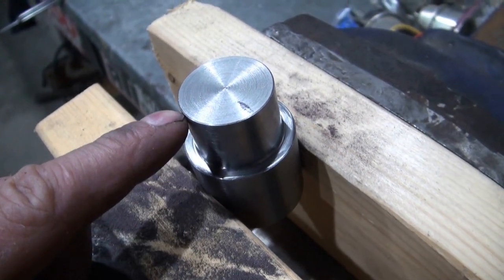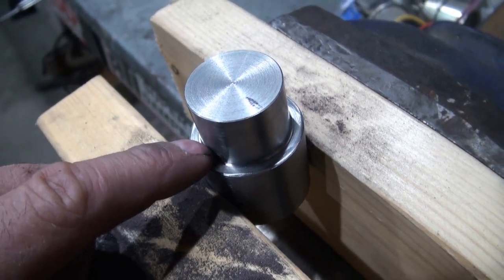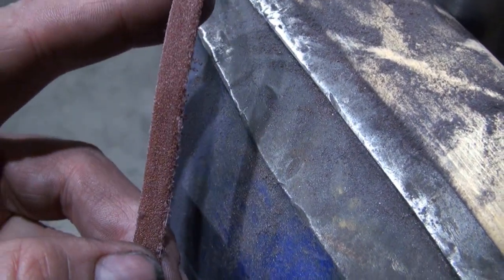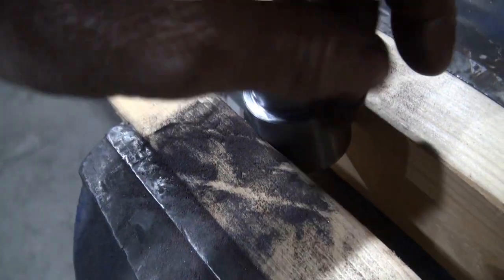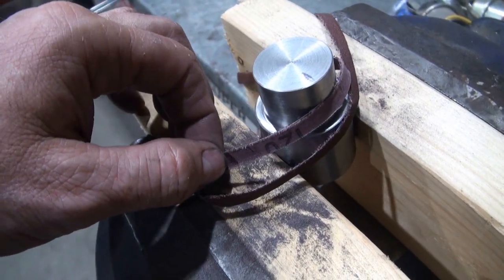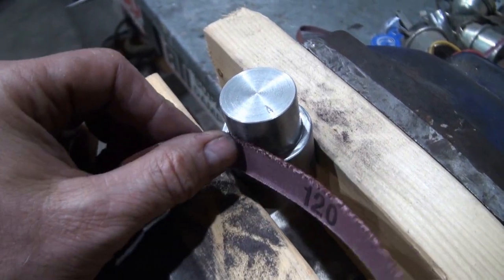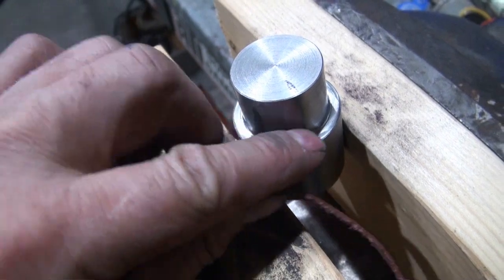The top end — I didn't want to remove any more there, it was actually very slightly on the small side already — and here on the bottom I needed to sand more. So I got some new strips and tore them into narrow pieces. I knew I needed to sand more off the bottom and I didn't want to continue with that taper, so I sanded twice with a strip that was narrow like that, and the leftover piece I sanded as well, so it couldn't sand up into the top. I was trying to concentrate on getting the bottom narrower.